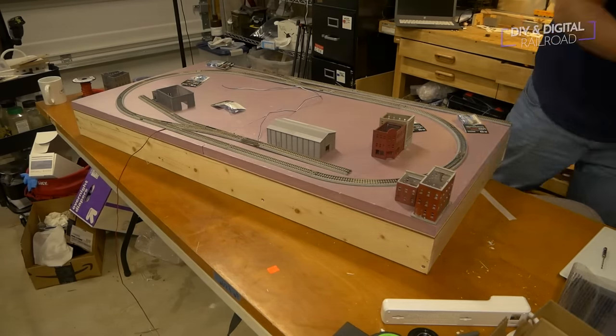For the wiring setup, you see three wires from the switches. One is the overall power, and one powers the LED indicator in the switch. These both need to be connected to the red side of the bus. The black wire of the switch then hooks up to the red end of the LEDs we are using for building lights. We then connect the black wires of the LEDs to the black side of the power bus.